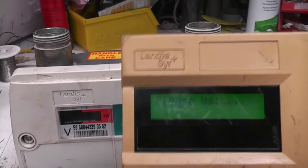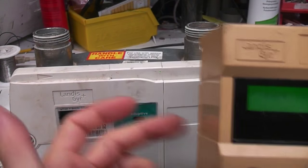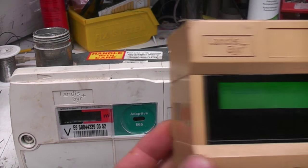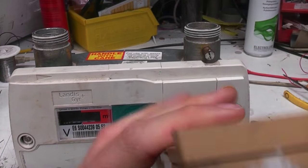When it's off and I click the button it says 'please wait' forever, so that 'please wait' is actually doing some infrared protocol with the main meter trying to talk to it. So it could be that a lot of the functionality is actually in the main meter and this is basically not much more than a user interface.